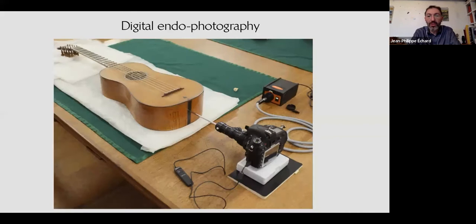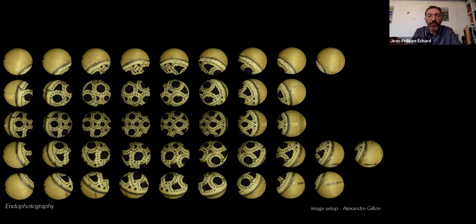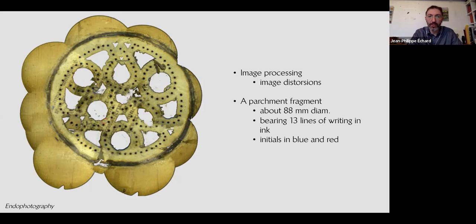The endoscope is an optical system that allows making photographs, though they are not perfect given the limited field of view. You need to rotate the endoscope, and there is a small prism device allowing capture in various orientations. To image the inside of the rosette, I had to make many photographs and then arrange them with image processing, assembling and merging them into a single image. This is an interesting reconstruction, but not perfect — there are geometrical distortions and the reconstruction process is not fully optimized.